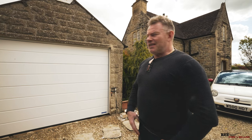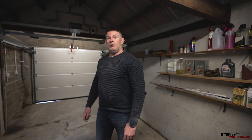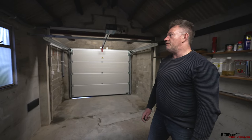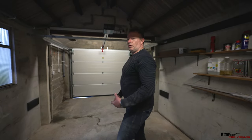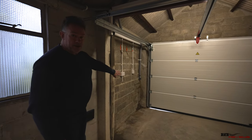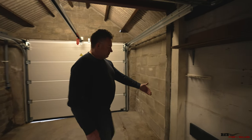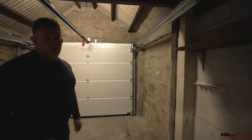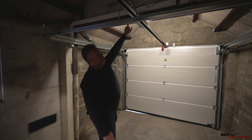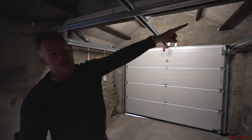I think even now you can see it's a massive difference. So, new garage door in, it's done, finally. I'll just walk you through the bits of work that have been performed. If you can remember, these pillars came out to about here, all been cut back. Same on that side, pillar out to here, all been cut back. Obviously, you have to retain the strength, so the old lintel removed and a new steel lintel put in, and put across the supporting pillars.